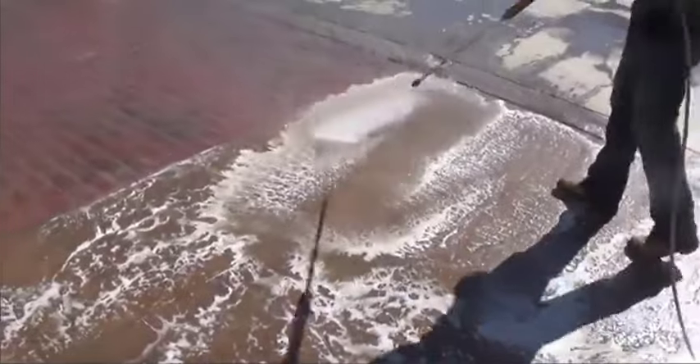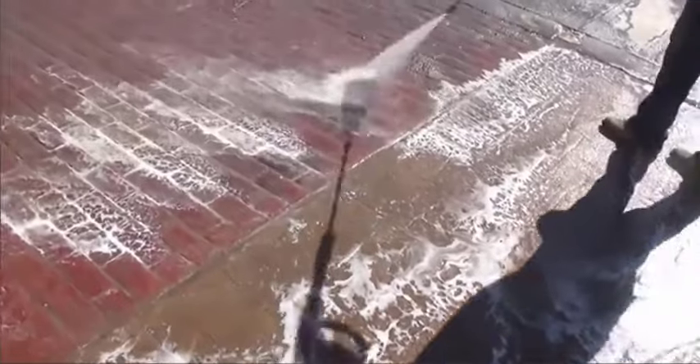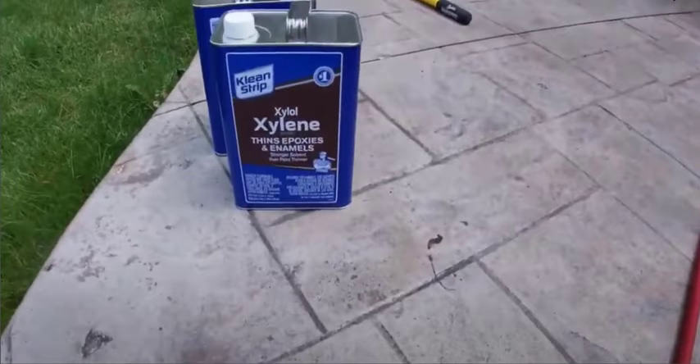If you don't have one of those surface cleaner units, you can just try straight pressure washing — it doesn't work quite as well but will help remove some of it. For solvent-based sealer, we're going to use xylene again. Xylene is going to thin that sealer and turn it back into a gooey, loosened-up mess — but this is one of the best methods for getting that white solvent-based sealer off your concrete so you can reseal it to make it look like new.